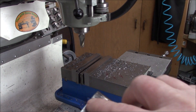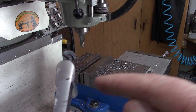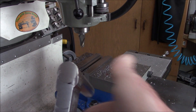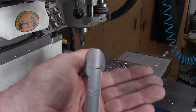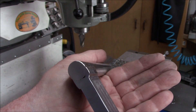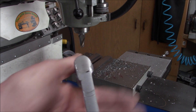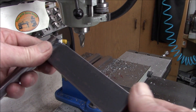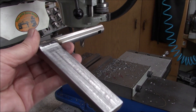It did have the radius that we needed so that we get a smooth edge here. You can see the weld penetration was not that deep, so that's why I wanted to make sure I just left the radius on there to give it as much strength as we could. I got it all chamfered and deburred, so let's go see if it'll fit in the shaper.